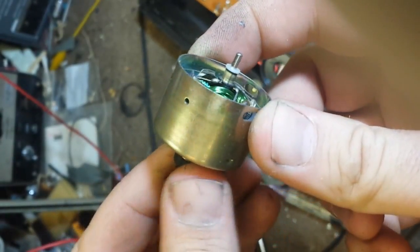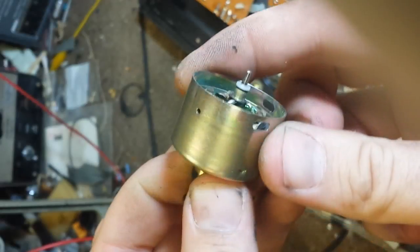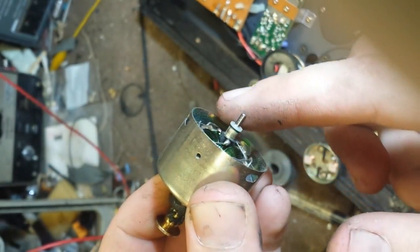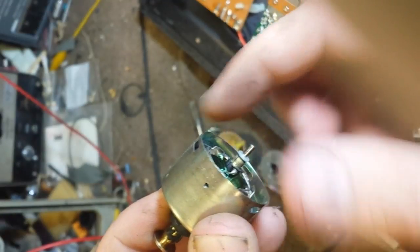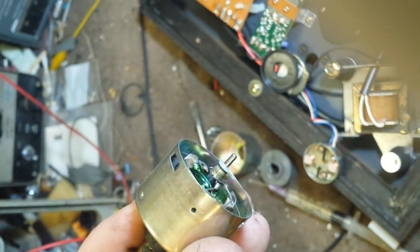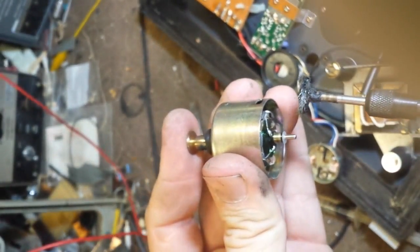That's actually straightforward. I use a Dremel tool with a very fine wire brush, and I will coat this in DeoxIT as I go around it in a circular motion with the Dremel tool to clean it up and polish it. That will aid in the motor's longevity. So we've got the DeoxIT on there, we've got our Dremel — let's clean this up. Headphone users, beware.